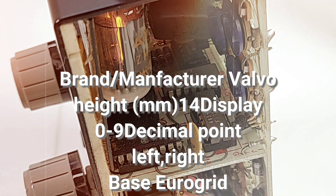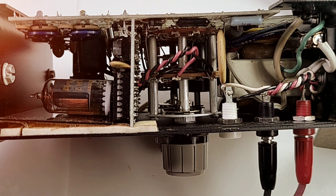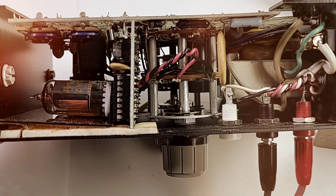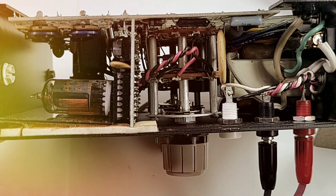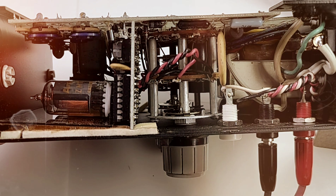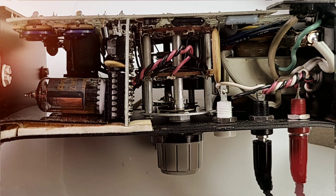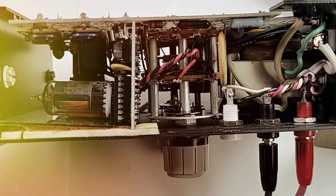It's a big multimeter, but they managed to fit a lot of components into this space. All of the logic circuitry is TTL — transistor-to-transistor logic. The range is 0 to 200 and the maximum error back then was a few counts plus 1%, so considering the time, this was considered cutting-edge precision. They're converting AC into DC for the AC ranges, and there's a constant current source for all of the resistance ranges as well — not bad technology.